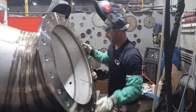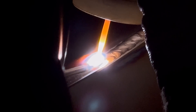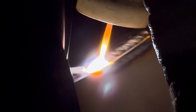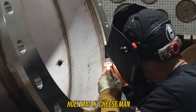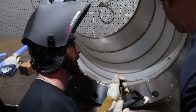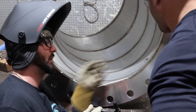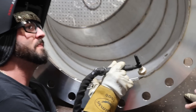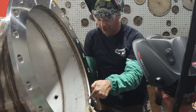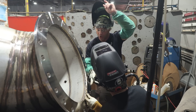I got itchy and wanted to weld. Holy mac and cheese, my hand is on fire. I'm seeing some issues though - my wire keeps wanting to stay in the middle. I need to remind myself to keep it bumped up to that edge. It makes the wire run away from me. I'm just putting enough filler on that corner and then washing it off - if you don't dump enough filler in there when you wash it to the end, it's going to undercut.